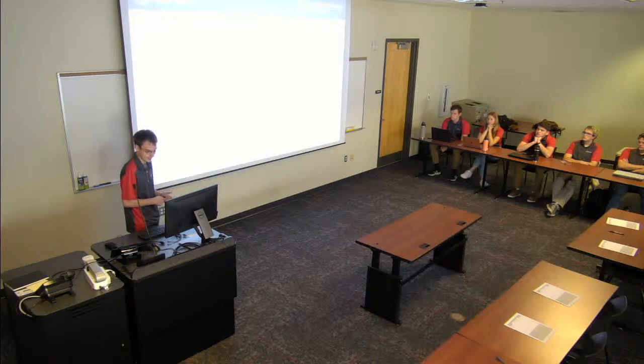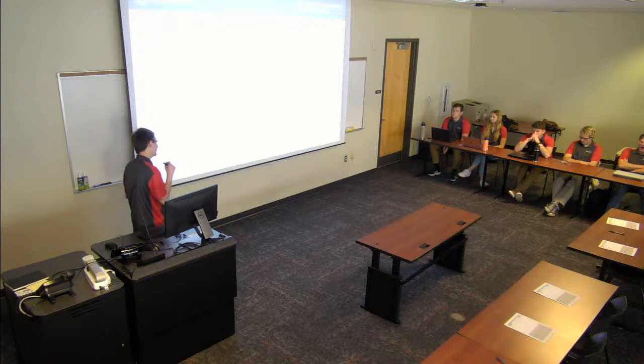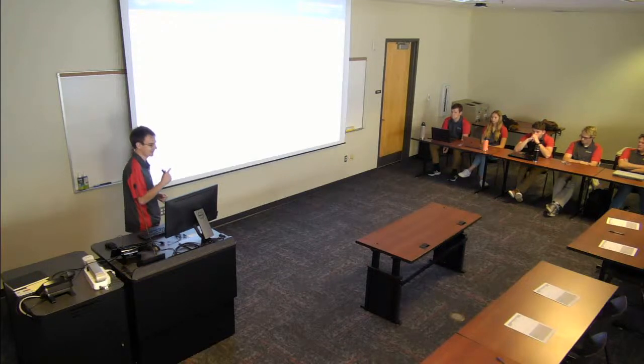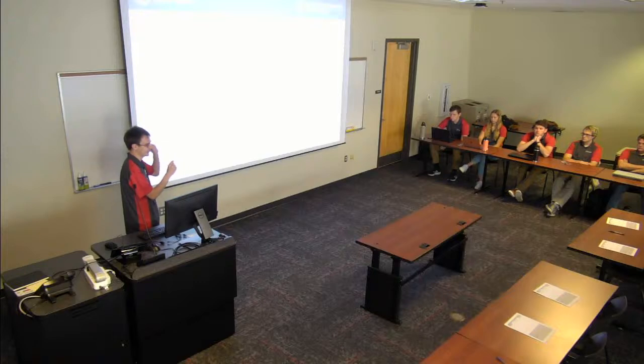And for the camera, the payload idea we're going to do with the electricity is to power a camera. We're going to log that data as far as we know. Since the power generation will be intermittent, it's not going to be a constant power. I'm thinking we're going to have the camera powered by an Arduino, but only have it fire when a signal from this system is sent, and that'll make it take a picture.